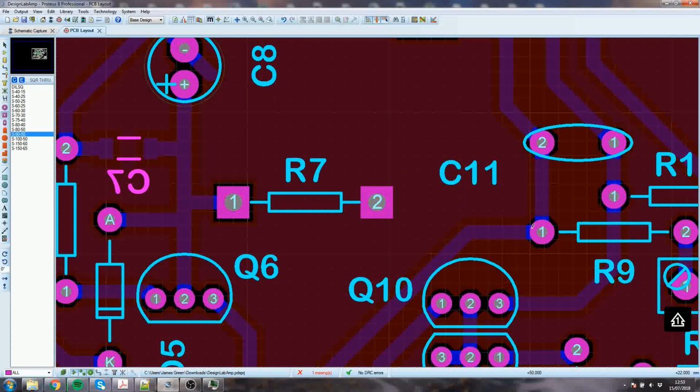When you've got little bits like the pads and you put the soldering iron on them, the heat effectively unglues the pad a bit, and if you have to rework the board, maybe because there's a mistake or you need a design change, I don't know what, you will thermally cycle that little bit of glue. And it'll go hot, cold, hot, cold, hot, cold, and eventually the glue gives up the ghost and the pad comes off on the end of the iron. And then you wipe it on the sponge, and then you swear because you can't solder to the pad anymore, and you have to have a little wire jumper to a bit of the track, and if there's a solder mask, you have to scrape away the solder mask with the scalpel so you can get to a little bit of copper that you can solder to.